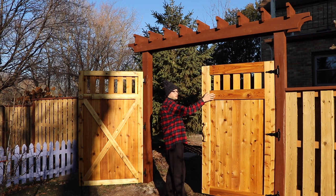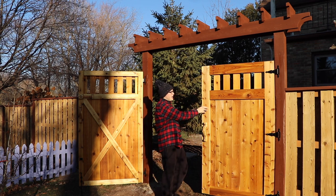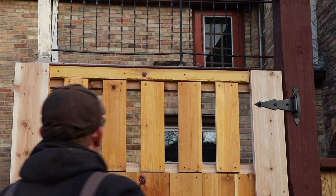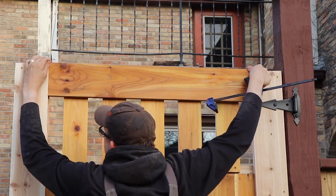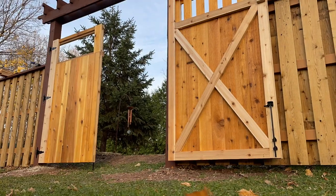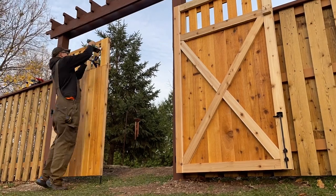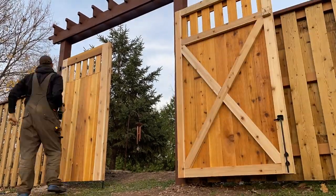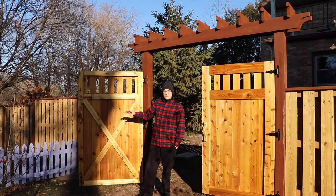I did the vertical paneling and then the sub fascia and main fascia. This is both aesthetically pleasing and it hides the two-by-four — this one-by-six strip up here hides this two-by-four, same with the top and bottom, so from the outside it just looks absolutely perfect, same on the inside. When I close this gate there's about a finger width — roughly half an inch — between the two doors. They're not going to expand enough to bump into each other, but I didn't want them too close — don't want them rubbing or expanding into each other.